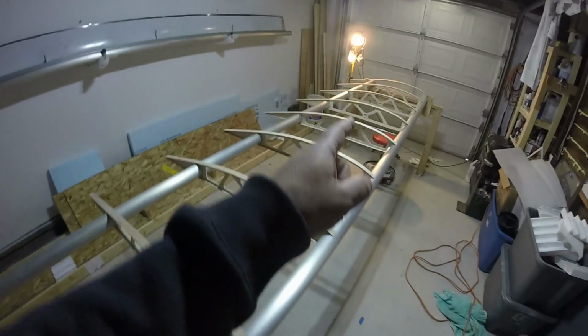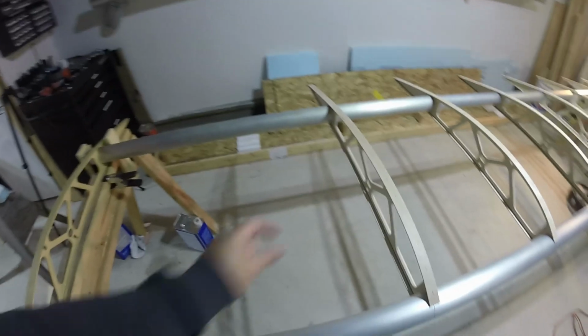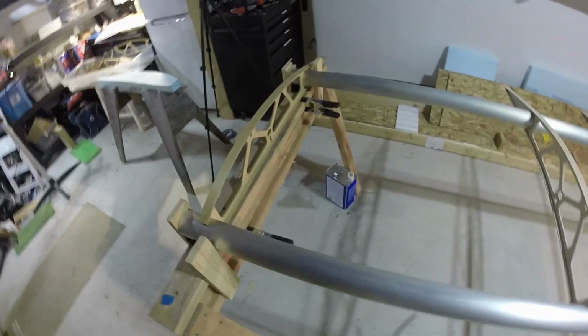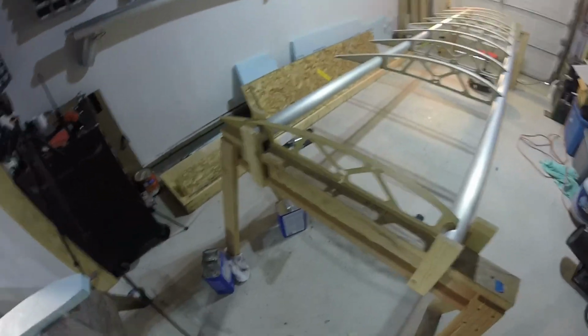I could mix and match these at this point because those aluminum stringers stop here at rib number 3 because they can't pass through the fuel tank, obviously. And then I think you just use wooden blocks out here to space up for those false ribs. Since this particular rib doesn't get bonded at this point, I'll be able to use this same rib over when I frame up the right wing.